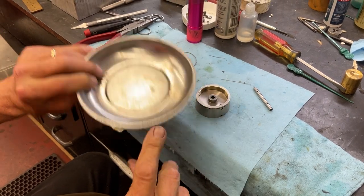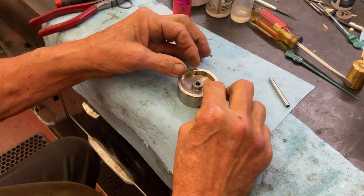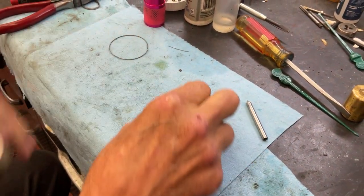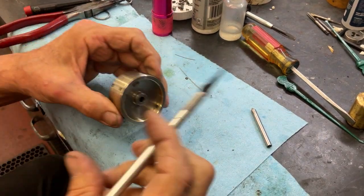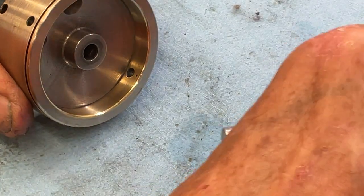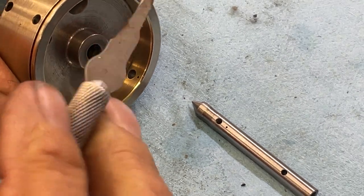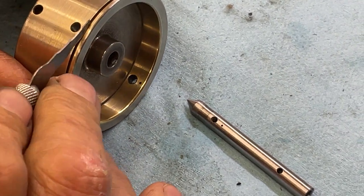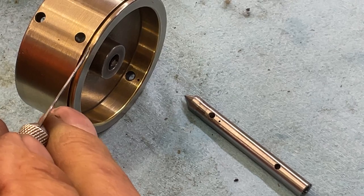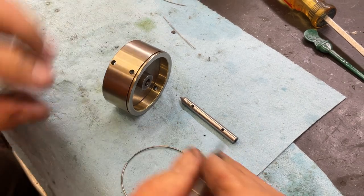I use a magnetic tray to hold those. So what you have to do is you have to get some 20 thousandths music wire and it goes from that little hole through the shaft little hole to the other side. Now what you wanna do is trim it so it doesn't come out in the slot here, because we have a retaining ring like a Victor spring barrel that we have to put in there that holds the wire in place because it'll move a little.